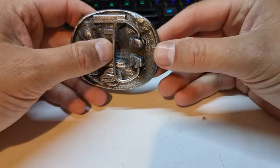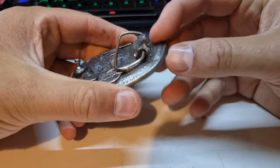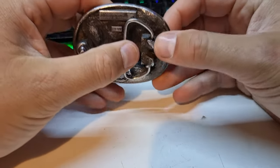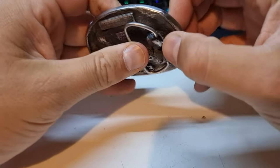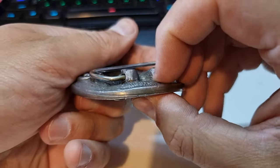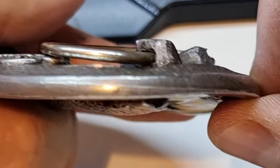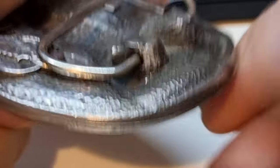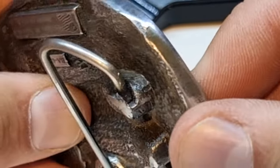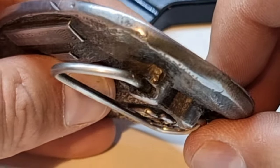Okay, well it's a couple of days later and some lessons have been learnt. Primarily, I did not in any way get this hot enough to bond the solder properly, because the plug of solder just popped straight out. And this little build-up here — we can see it wasn't really bonded all that well. There wasn't really all that much bonding happening in there, and I need to try a bit harder with that.